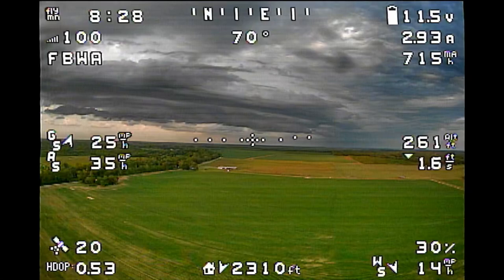That 3-amp draw at 30% throttle while holding altitude confirms I could potentially lower the cruise throttle for a more efficient setup. To do that properly in cruise flight mode I'd need to adjust the cruise throttle and re-level the board at whatever pitch angle it's flying at now to maintain altitude. I was manually holding altitude so I can review the log later, find the actual pitch angle, and trim accordingly at a later date.